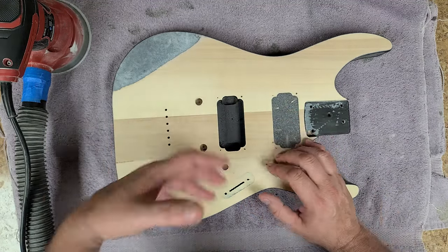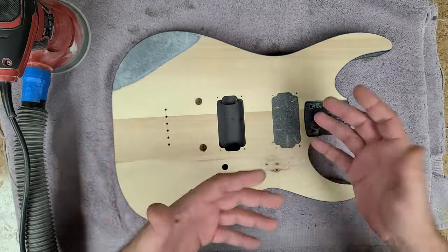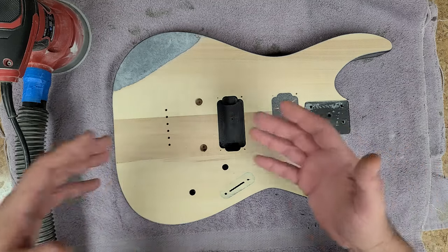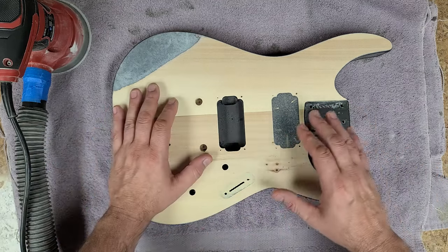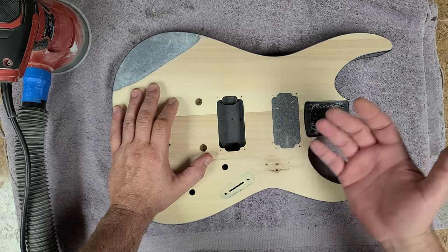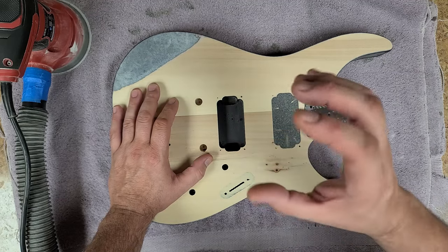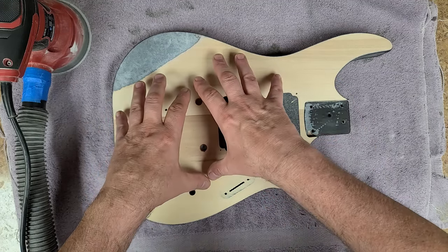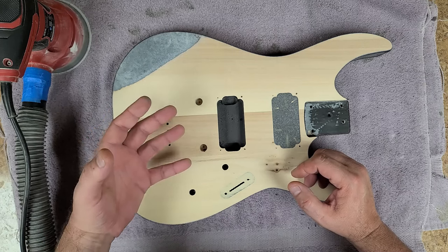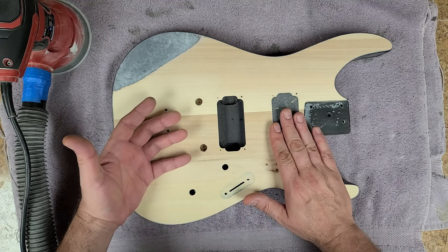This liquid glass is good for deep molds, like if you're doing jewelry or casting a heart or diamond, or like I used to do with the eggs. This stuff works better because it's a thinner viscosity than the other epoxy resin that I use for countertops. All the air bubbles come up a lot easier. So when you're doing a deep pour and there are air bubbles from mixing it, they come up and pop, and there are no bubbles inside the epoxy as you're looking through whatever you've made. The stuff that I use for the tops on these is a lot thicker. It ends up making bubbles, and it does get harder quicker because it heats up. The liquid glass does not, so it takes a longer time to cure.